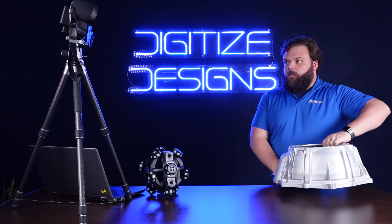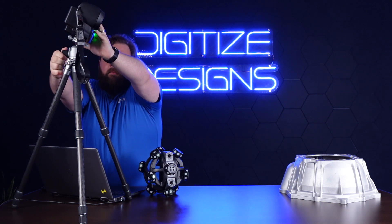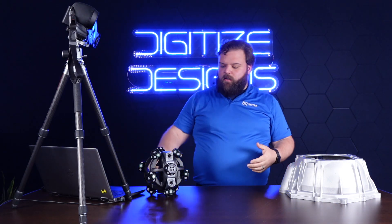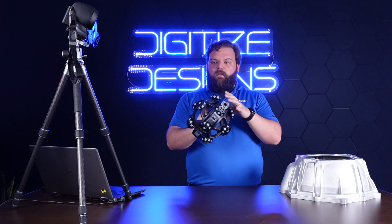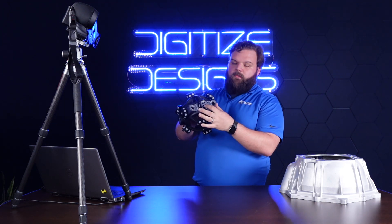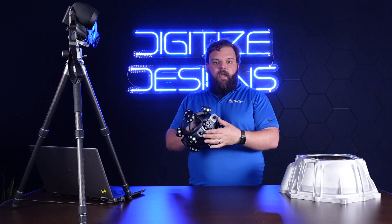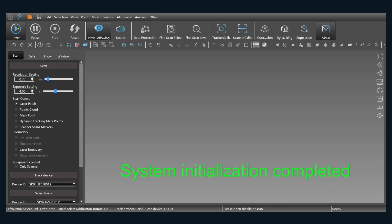There's a little ball joint on there so you can aim it, and a yaw joint too. The way this works is: as long as these two cameras on the tracker can see some of the targets on this orb — the scanner itself — it knows where the scanner is in space within the coordinate system of the tracker. You've got two smaller cameras and some laser emitters on this device. Those laser emitters project a laser grid onto the surface, pick that data up with the cameras, and make really accurate 3D measurements, placed accurately in this volume because of the tracker watching the scanner.